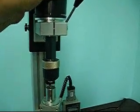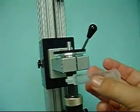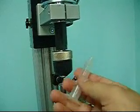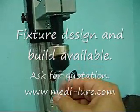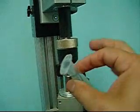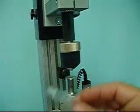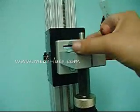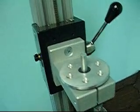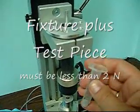Let's take this one step further. We'll take this off and go back to the base weight. If the piece you're going to test is a larger piece and has no good way to hook up to this chuck, you're going to have to build a fixture to hold it — something lightweight so that the fixture fits into the chuck and the piece fits into the fixture. You will need the weight of the piece and fixture to know how to adjust. If the weight of the piece and fixture is one newton, you only need a single one-newton wafer on top. If your piece is two newtons, you won't use either wafer to reach the five-newton base weight.